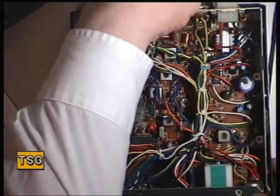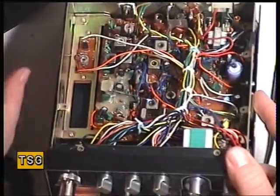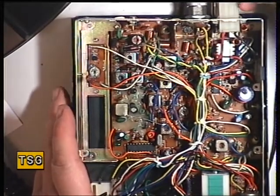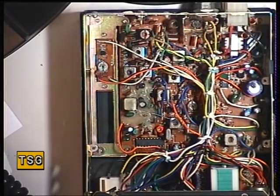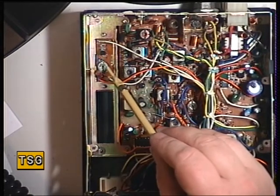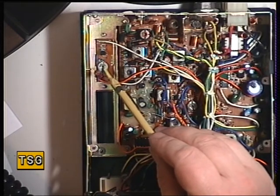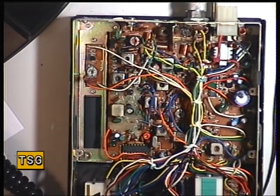What I tend to do with these - and I should say don't do this at home - I've unplugged the antenna connector, I'm going to just press transmit for a second, the AWI comes on. Done. And if it didn't, with the dummy load connected onto the instrument as it is, I'm going to transmit on channel 20 and then adjust the AWI preset until the AWI light just comes on, then back it off until it just goes off - that seems to be the threshold of that circuit. There we are. I'll put it back together and we'll see if there's anybody on the air. I'll be lucky.